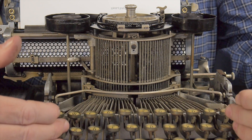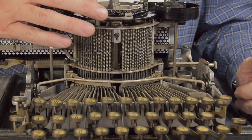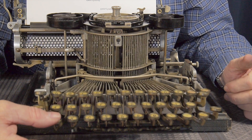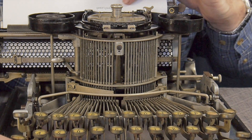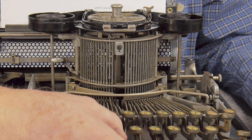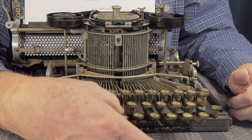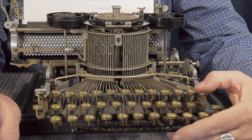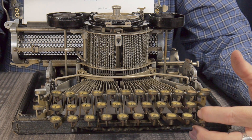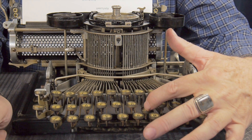The keyboard is split in half — half of the keyboard types on this side and the other half types from the letters on this side. So if I press one way out on the edge, the Z key, you can see how it rotates the shuttle way over. The ones in the middle, not so much. The throw of the keys in the middle of the keyboard are shorter than the ones on the outside of the keyboard, which push further down. Same on this side — if I press on this side, you're going to see this shuttle rotate over to this side. And same if it's in the middle, not so much.